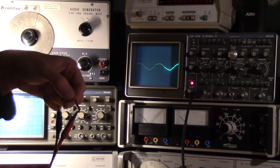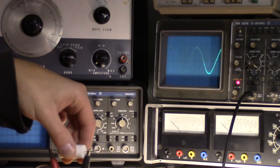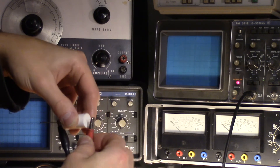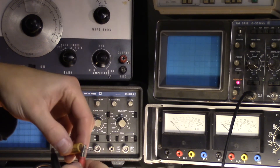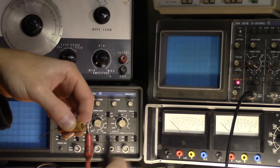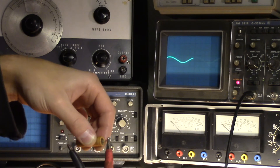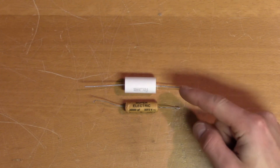Like there was ever any doubt. Now let's do a direct comparison between the old wax capacitor and the new film capacitor. Here we have a new capacitor — 20mV peak to peak. Let's change polarity. Same level. Now we'll test the old wax capacitor. It's a little higher, around 40mV peak to peak. Let's change polarity. And now it's a lot less — about 5mV peak to peak.